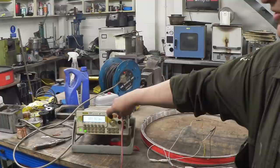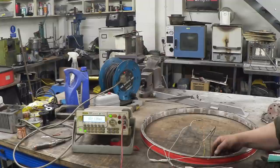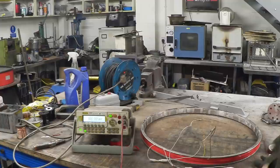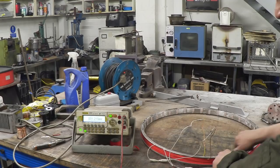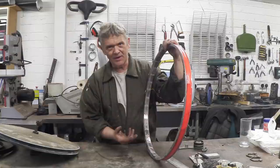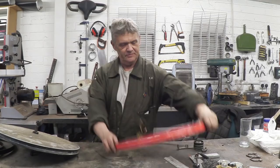Here's my wheel laid down, connected up to the multimeter. I'm trying the Kapton tape trick that I was asked to try so hopefully you'll be able to read the meter. What I've got here is two ceramic magnets facing north-south, north-south, and if we push them along that ring we get generation. There are the ceramic magnets — and there we go, 98 millivolts, that's actually super cool. If I put the magnets onto the side and give them a push — next to nothing. At this stage 100 millivolts is pretty cool; it's telling us our idea is working. These interdigitating fingers are working a bit like an alternator, a bit like that motor we took out of the microwave, and we got one big coil generating something out of it.